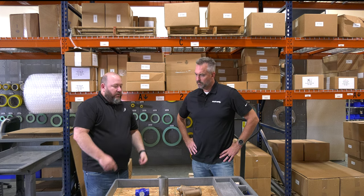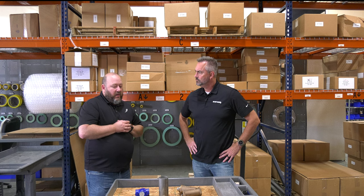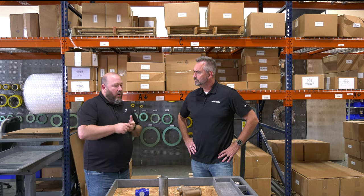We'll see strainers in traps, other types of valving systems. In our world, I talked about pumps, protecting control valves, pressure reducing valves, oil pumps — really anything you've got, especially gas regulation and gas valves. You're really just trying to protect any kind of sediment from getting stuck in that equipment so it won't fail to operate or get damaged.